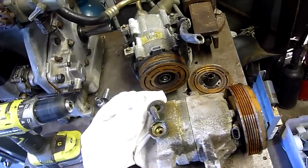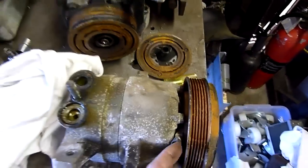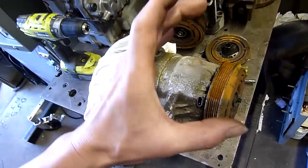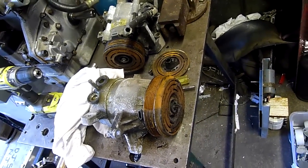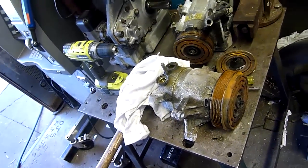Hopefully that one will just slip off because it's still fairly new and well greased. This one here might be a case of a lot of brute force - as long as I don't warp the outer rim it's fine. What I'm going to do is machine a steel slug to go inside it. There's an inner lip there, so I'll machine a steel disc to fit inside it, weld it in, then drill it up in the lathe, bore it and key it. I'll probably have to do that at work - I'll EDM the key in it.